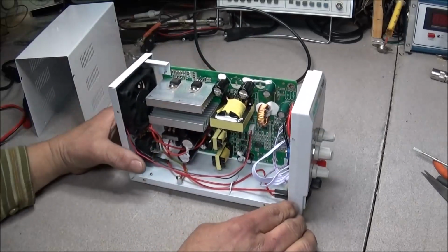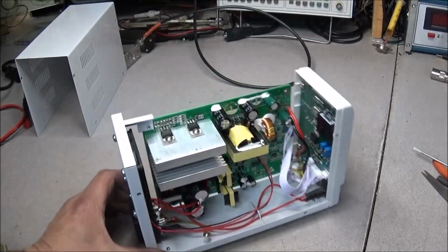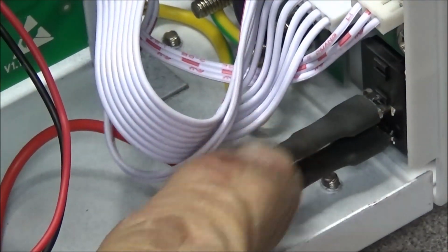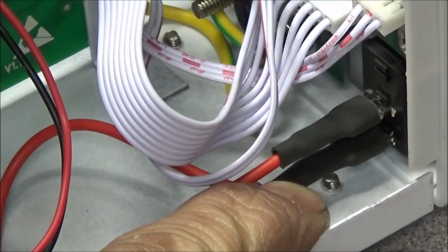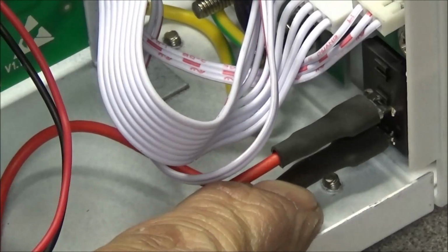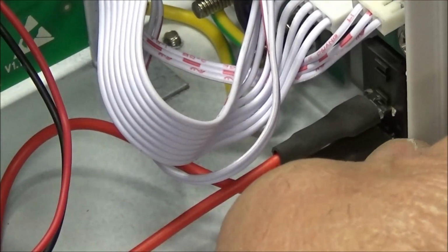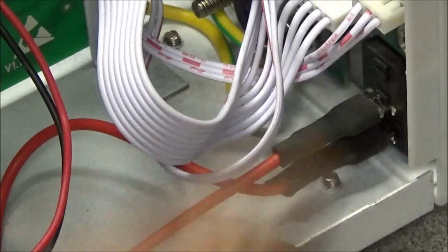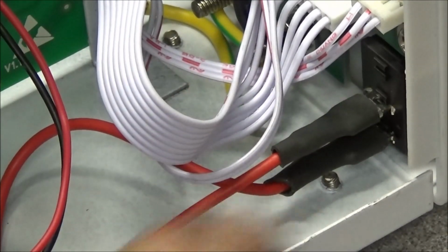Another thing, and Mike did point this out, here at the front where your AC wires go to it, you don't have to do the top one, but the bottom, put some heat shrink on it, because directly under that is a screw, and if something happened where this was to flex or the switch was to break, you know, it's a plastic switch holder, it could break, it'll go down and AC is going to hit this case.